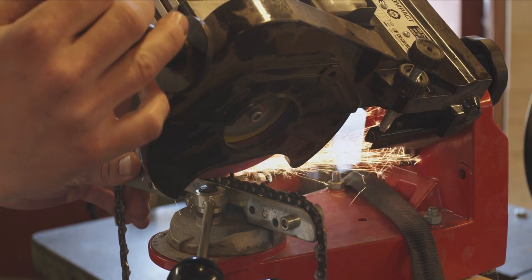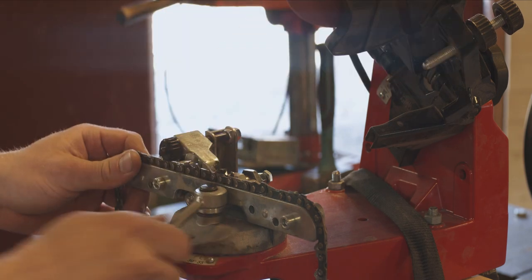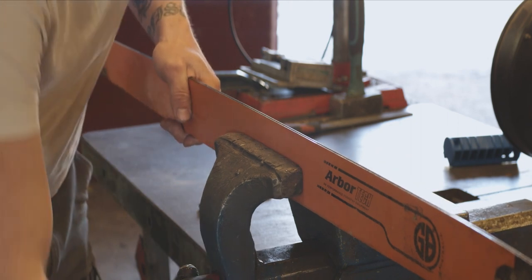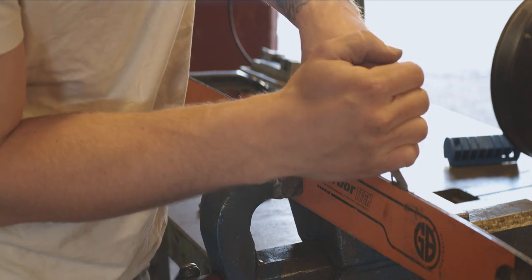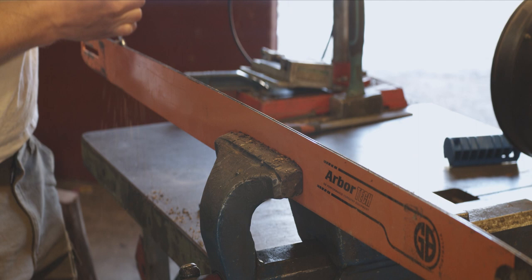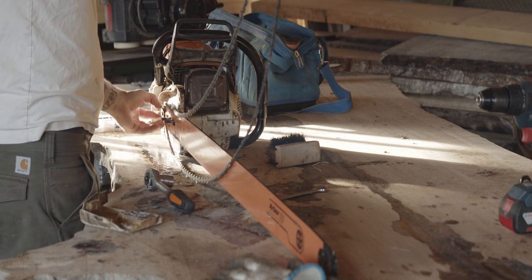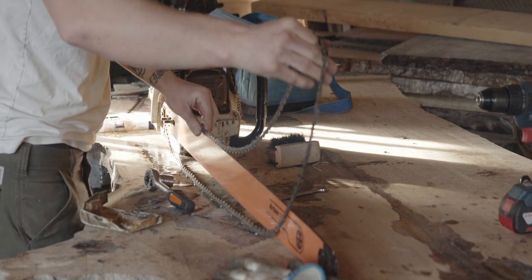What is relevant, however, is the cost of repairs. Saw chain is repairable — if you have a few cutters that get damaged, you can either replace them fairly quickly, or if there's minor damage, you can grind them back with a chain grinder. Tools and equipment for chainsaw milling are fairly inexpensive and easy to use, which is a big plus. For bandsaws, you really need a machine that does both the sharpening and corrects the set of the teeth, and these cost a little bit more money.